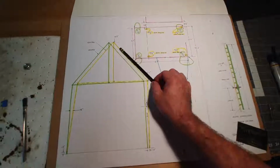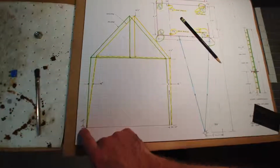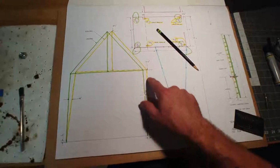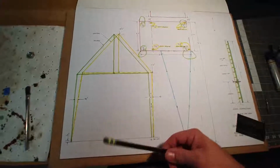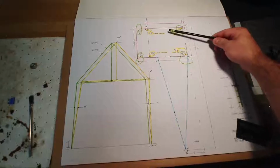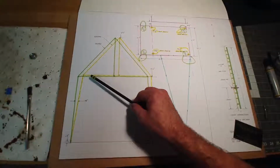So once again checking my work, that triangle system has just migrated as a result of the wall going up and going out, and it essentially is copacetic. Everything works out within tolerances at scale to my numbers that I found on the building. So it's clear to me that the front corner here has gone up, and they cut a hole for the garage door, and that walked off the foundation, and it has created the visual issues that we're seeing.